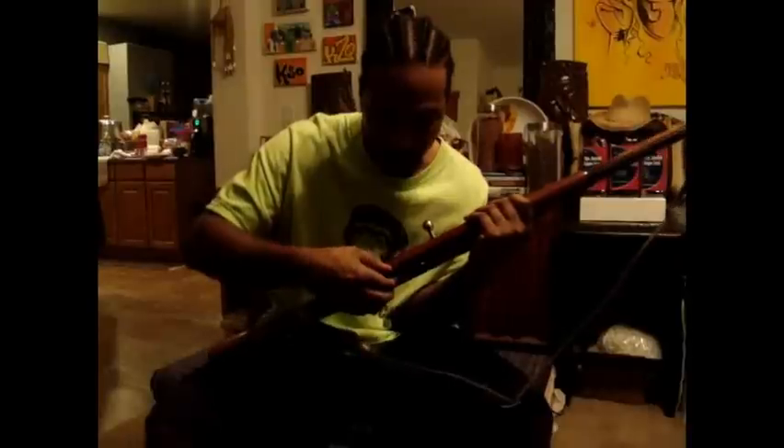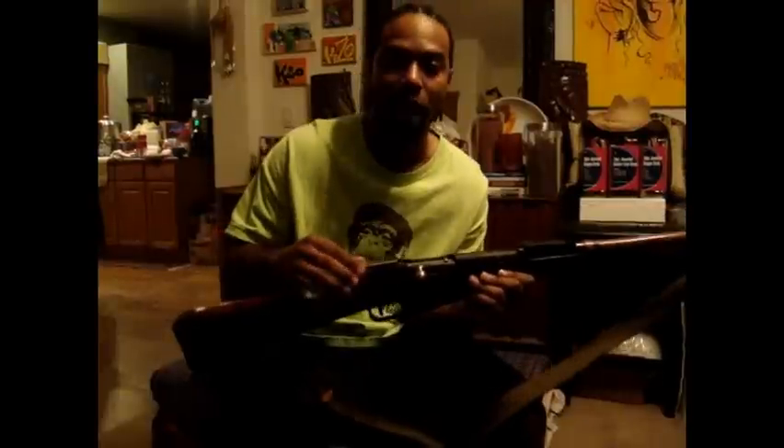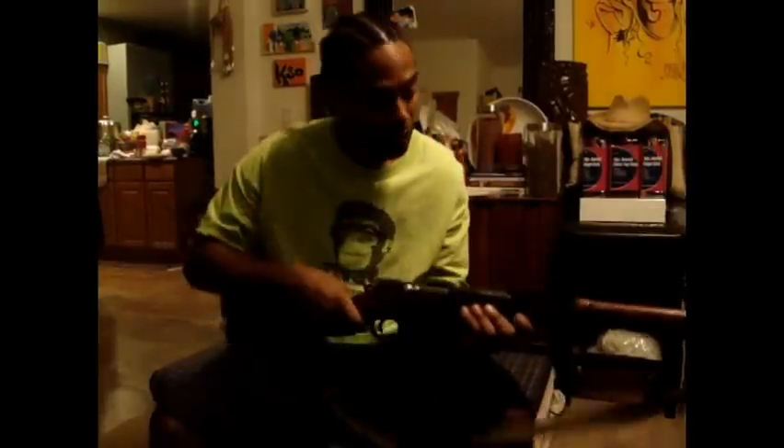Note to self, folks — if you do decide to get a Mosin and you strip it down, clean it, take it apart, make sure that you do not let the little trigger pin here, located where the trigger is, fall out, because you will not be able to extract the bolt after assembling it. I already made that mistake; I hope that you don't. It's a little pin about yay big, and believe me, it's crucial.